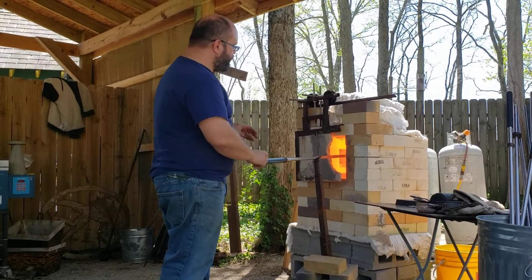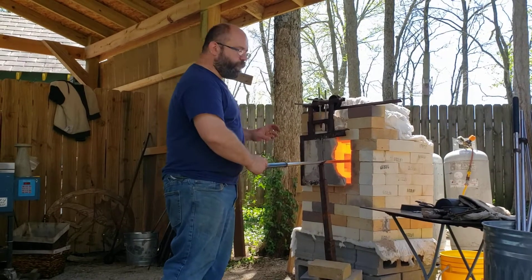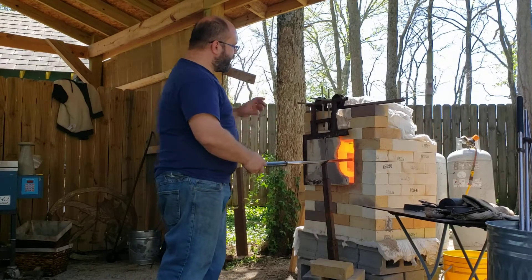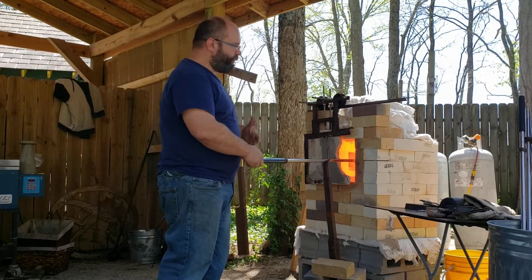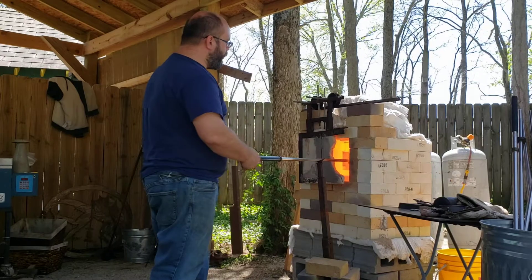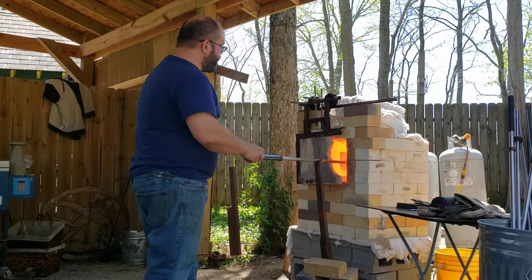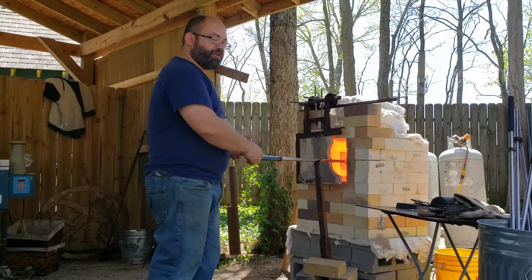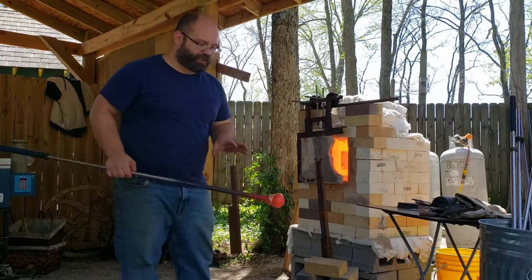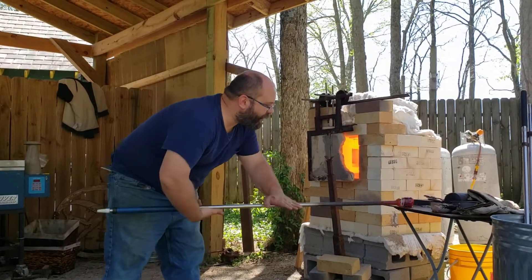It takes a little bit of time to get those twists in, and in that time the glass is cooling down. So I'm going to go back into the furnace and warm it back up, and let most of that texture melt away. If I don't, when I gather over it, that viscous liquid inside the furnace isn't going to flow into those divots and pitches very well and will trap big air bubbles. I don't mind small air bubbles, but large ones can become structural issues — they might get too close to the surface and pop, leaving little sharp edges. So I've melted most of that texture away. What doesn't melt, I will press out on this table.